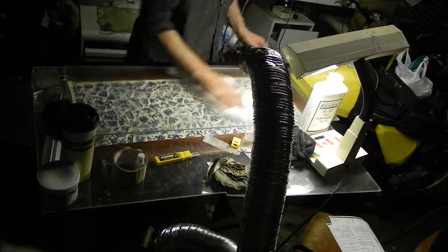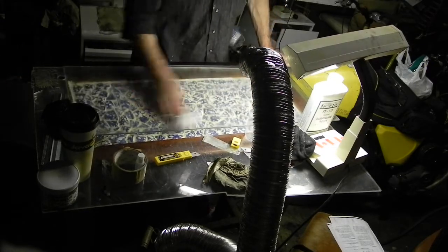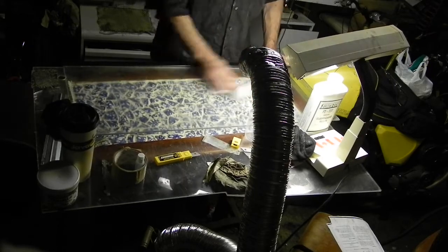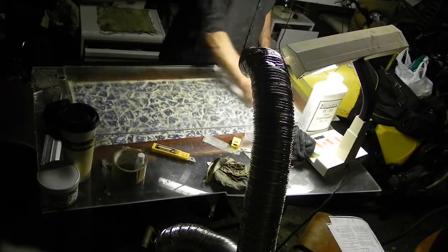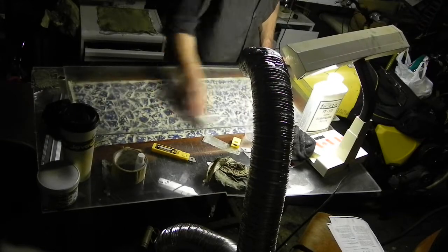Cutting that was a little bit difficult at first, but if you take tape — packing tape, not too tacky — you can tape the fibers in place while you razor blade cut them with a fresh utility blade. It's really important that it's fresh when you're cutting Kevlar because it's very, very resistant to cutting.